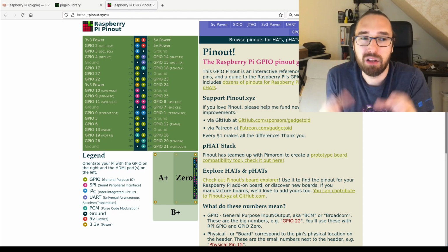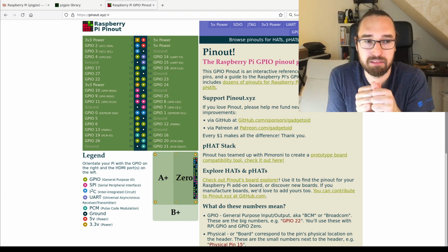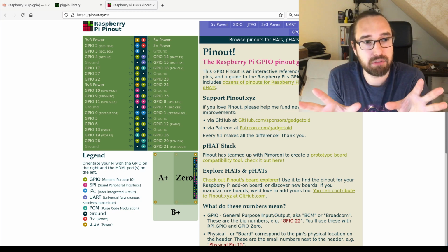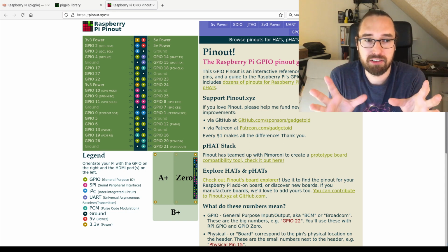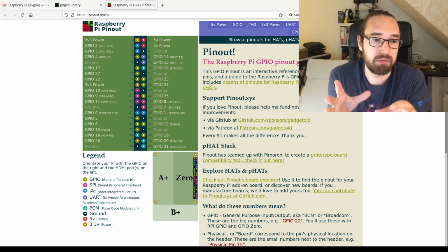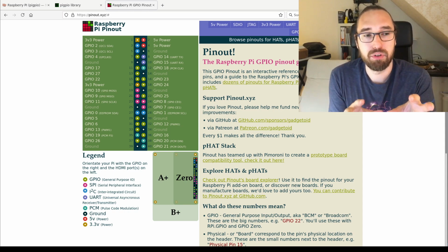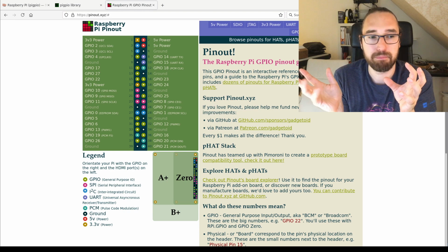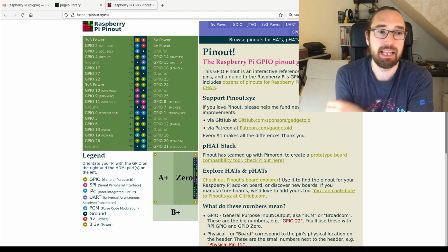You probably cannot do a lot of video stuff. So if you want to run multiple videos at once, that will probably cause lags. But you can run 1 video or sometimes some video if you're careful with your resolution, right? You cannot do 4K. You might be able to do full HD, but I would stick to 720p or something. That would probably not be such a problem, right? Because you can do full HD, but then you would have to do more tuning, for example on the video encoding and so on. So that has to be right, otherwise it will be lagging on the Raspberry.